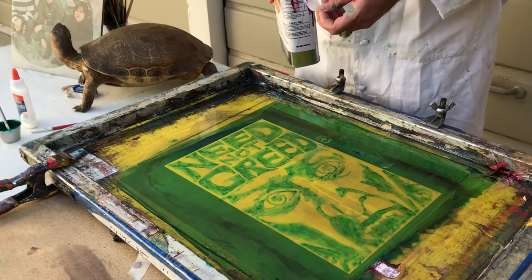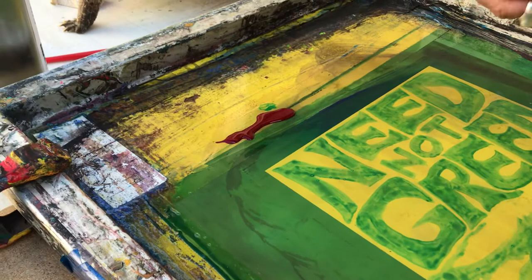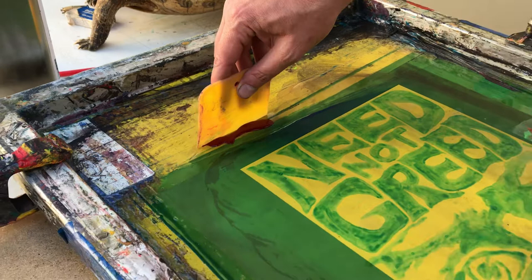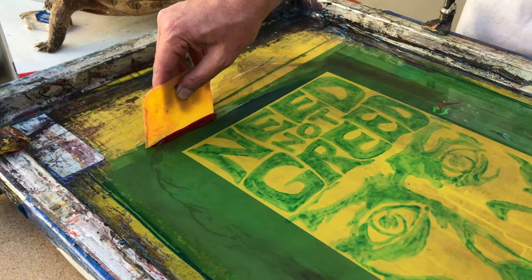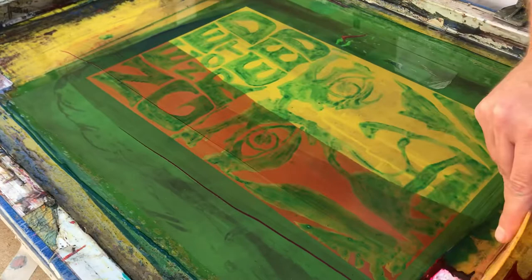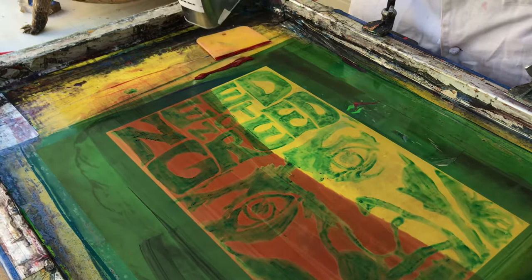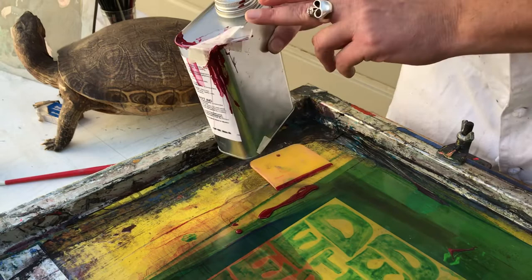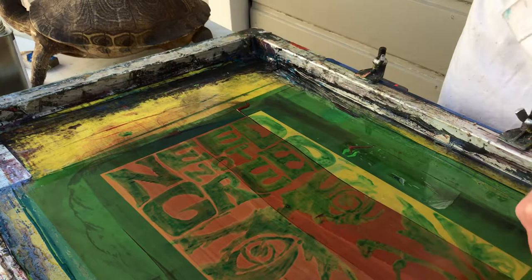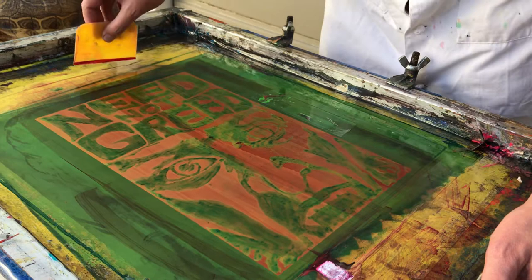Now I'm going to take my lacquer block out — or lacquer filler — and my nylon Bondo card that I tell all my students to get. Without making it contact the table, you want to do this fast. If you do this too thick it's going to be really hard to get off in the second step, so work fast and leave no gloss. A handy hint: just stab a hole in the container with a screwdriver and seal it with tape. One swipe — make sure you get all the areas, nice and thin.